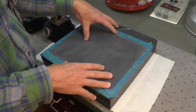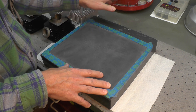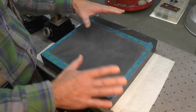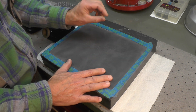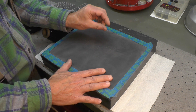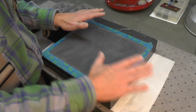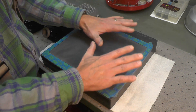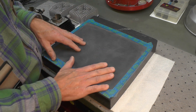One does not need a surface plate to do this. For years I used a piece of glass — I think I've even talked about that on another video, probably the TS-185 Suzuki. You can use a nice fairly thick piece of plate glass, which you can get at almost any glass supplier. Put it on a flat surface, keep it clean, then tape your sandpaper or abrasive material to the glass. That'll work just as well as the surface plate. But I'm going to use the surface plate because I have it and it's very flat.